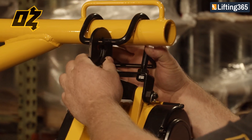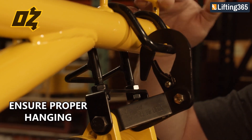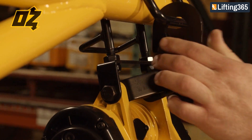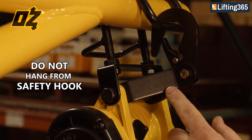Something very important with this wire rope hoist is that you have them hung properly. As you can see, it has a pipe style mount with a safety hook and latch. This hook is not to hang from — we have it stated on the hoist.